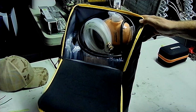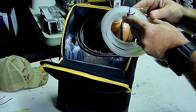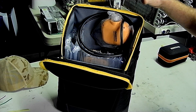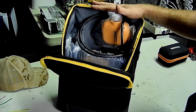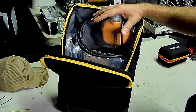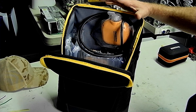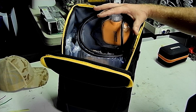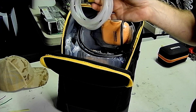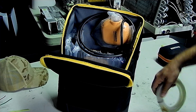There are a few differences between the CAT 85 and the CAT 45. The CAT 85 comes with a built-in manometer for testing gas pressure, static pressure, and so on. The CAT 85 also has what they call their HydroCycle, which eliminates the need for a catch cup for condensation — it just dumps the water back into the flue. Here's the tube for checking gas pressure with your manometer.